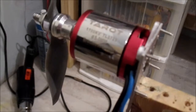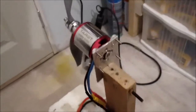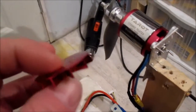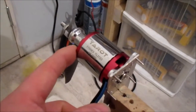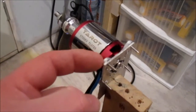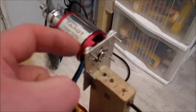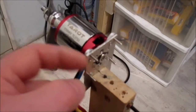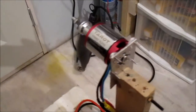It's a 1700kV TL3723. It's a heli motor but I've modified it a bit - I've taken the fan off the back and pushed the shaft through, converted it to a pusher motor. It's going to go on one of my delta planes. I've got a universal cross mount which I had to modify because the screw spacing was different. It spins nice and smooth.